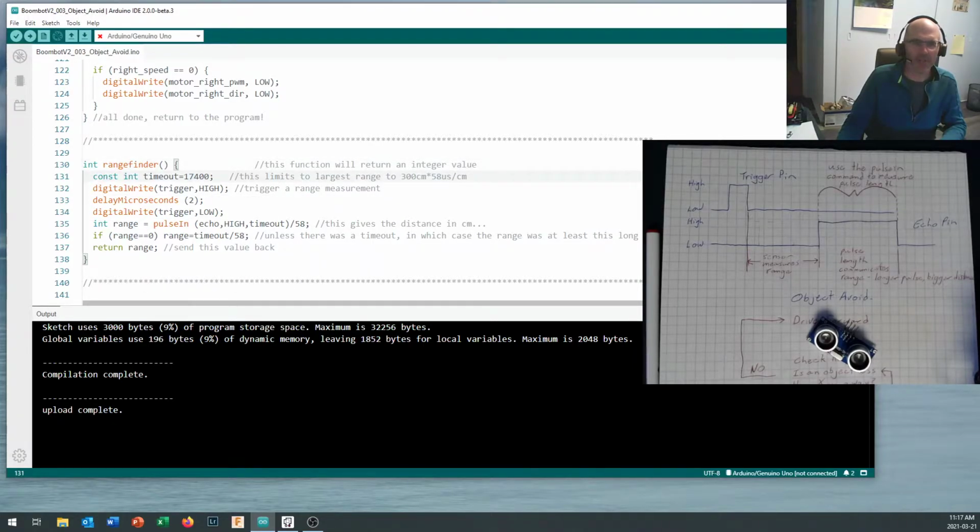Now, the first thing I've got in here is what you saw referred to in the description of the command as a timeout. When you hand control over to the pulseIn command, it will go in there and wait until it sees a pulse. We call this a blocking function. It's kind of like delay in that nothing else happens while it's waiting to see that pulse, just like nothing else happens when you're in the middle of a delay statement. And that's fine because it's busy listening for that pulse to come in.